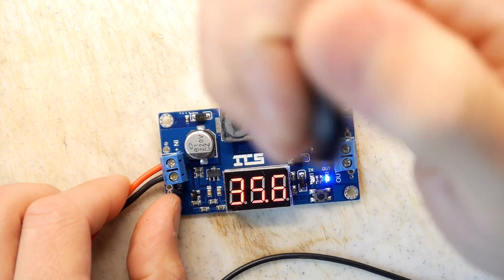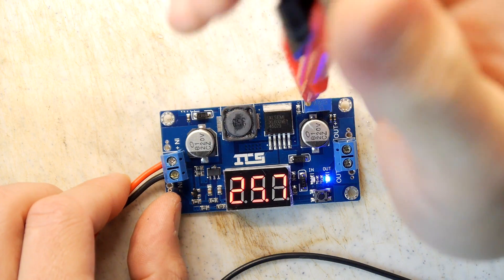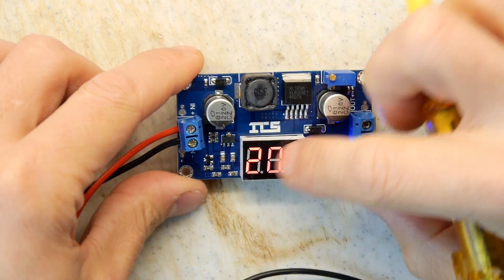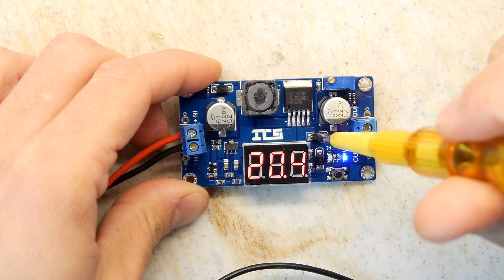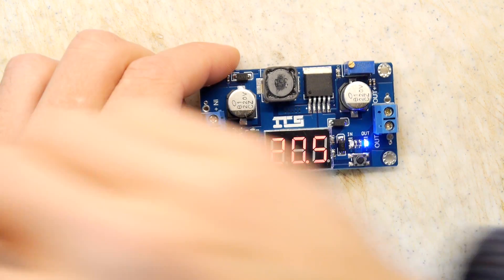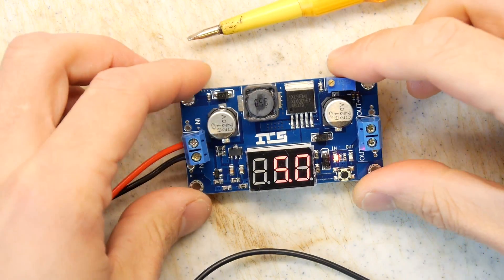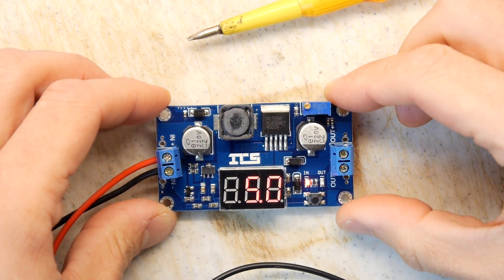Brilliant — I think it's a really good demonstrator, and if it's included in a curriculum I think you'd learn a lot. Looking at the chips now — we're down to 22 volts, a bit more safe. Underneath there is an IC — you won't be able to see it, it's just in there. That's the microcontroller doing the voltage stuff, and the actual power supply components are these ones here. That one looks like a voltage regulator, probably supplying 5 volts to keep the microcontroller fed. I hope that's been some use to you — please feel free to like or subscribe, comment down below, and as always, thank you for watching.